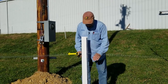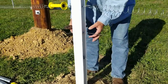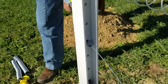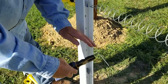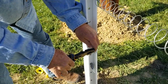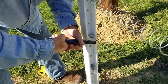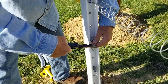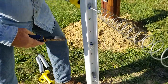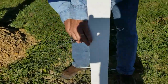In the H-post, what we decided to do is take a piece of high tensile wire and we took a gripple and put a gripple inside the channel on both sides. This is just a piece of wire we had left over, and I'm going to cut a piece off and create a hook right here that'll be for our spring gate to just slide onto, and put one on both sides.